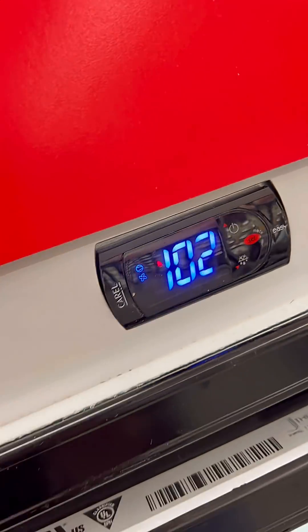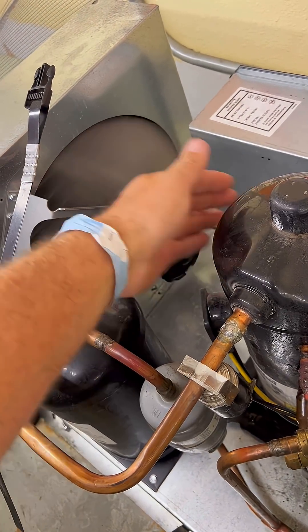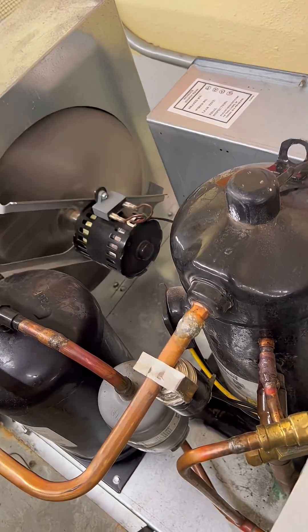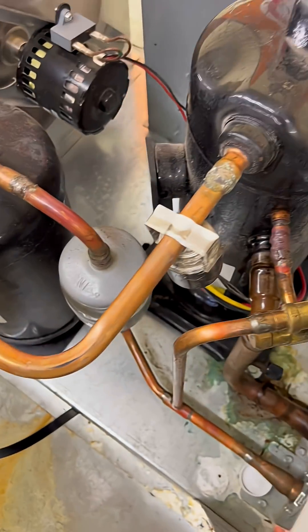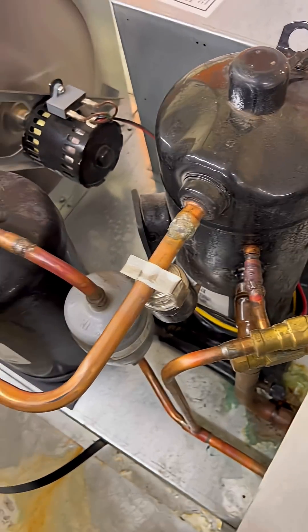It's calling for compressor and fans. Going here, you can see the compressor is running hot, but the air is cold. There is no reverse involved, so we don't have heat pump operation or defrost, which was my first idea.